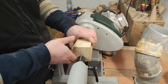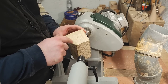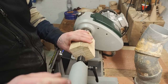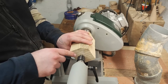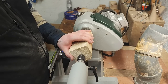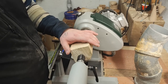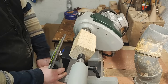I'm going to mount this between centers first and eyeball it. I have a sense of where I can get the biggest diameter, but it doesn't matter if it's a little bit off. On this side I don't have anything, so watching from this angle I want to center it, rotate it 90 degrees, and now center this way — a little bit off like that.